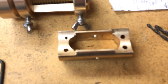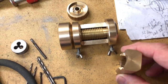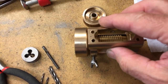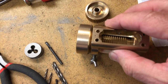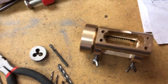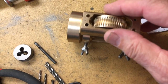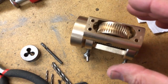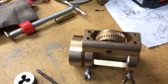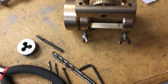In the previous episode we made a little gear wheel for this worm gear. The next stage is to make a housing for it, which is actually a little tricky — you can see some curves, we have to turn a slot, and we have to make flat surfaces on the side of this round shaft. This episode will include how to cut a thread, as you can see here the worm gear is driven by a thread.